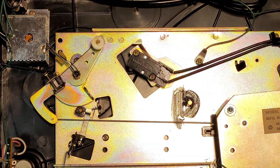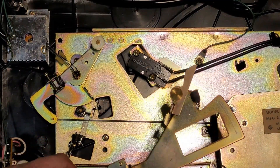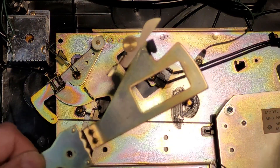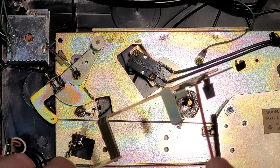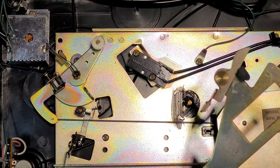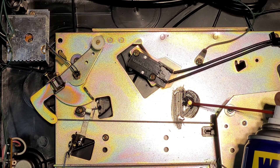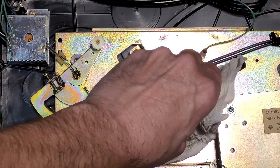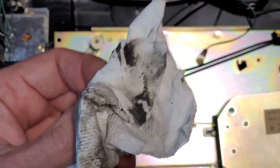I'm going to give it a shot of white lithium grease — it doesn't need a lot. Work it back and forth like that. That's better. While we're at it we're going to clean this mess down here too — soak it first with a little WD-40, then give it a wipe. See how WD-40 just annihilates grease? Don't lubricate with it, just clean with it.